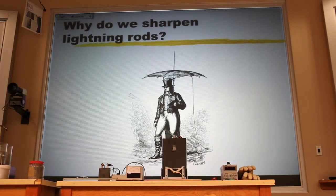Now, that's only because I've got a battery hooked to it. If instead I remove the battery after I charged it up, then it would be the electric field that stays constant. And then, by moving the plates half as far apart, I would cut the voltage by half, down to 3,000, and sure enough, the electron would hit the other plate. But as long as I've got that battery there, it's going to make sure that there's 6,000 volts between the plates. How does it do that?